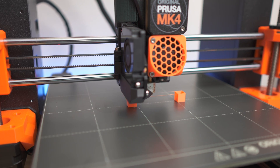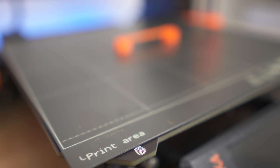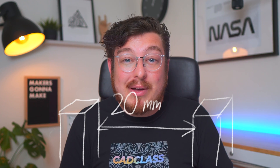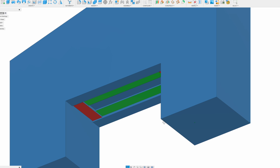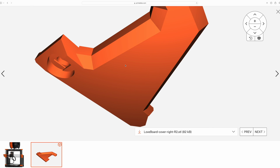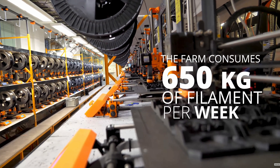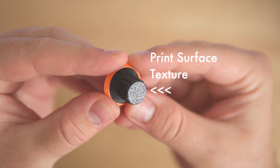Bridging in 3D printing is a horizontal surface that's supported between two pillars, and dialing in your printer settings to get the perfect bridge is often seen as the benchmark to hit. It's often achieved by extruding slightly less material than normal to add tension to a line, but at a certain distance, gravity will take over and leave you with a droopy surface. The classic minimum value for this is 20mm — anything smaller than that really doesn't need any support whatsoever. On a few printed parts on the Prusa MK4, you can see that the underside isn't flat at all, but looks like a series of stepped angled faces. This is a print made by a company that needs to be as efficient as possible, and minimizing support material is the name of the game. That's why even the knob was printed upside down so it doesn't need any support material inside it.